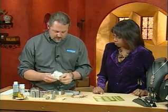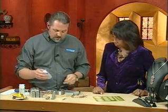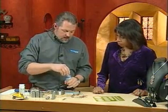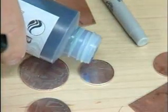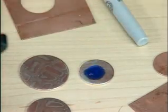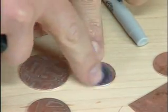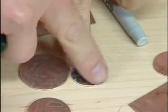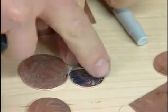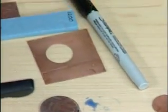Okay. And once it's dried, now this is a special patina developed really for Mokume. What it does is it oxidizes the copper, but not the silver. Oh, since there's both elements in there. Right. If we take that and move it around, see how that copper is just popping out? It popped, like a picture. It's incredible. Now we can wipe it off and rinse it.